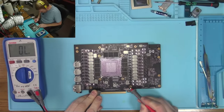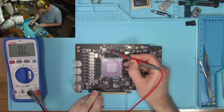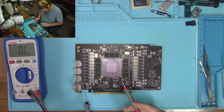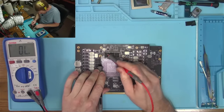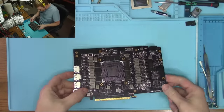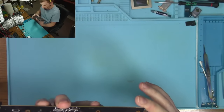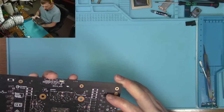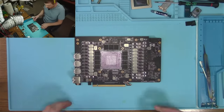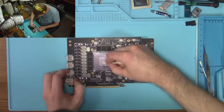Depending on who did, how this board was connected, specifically the controller for the memory phase and the core phase, it will dictate the outcome of whether or not the 4 volts is going to shoot into it without the core. That's the issue. You remove the core on 30 series cards, you run into a risk of shooting 4 volts into the core. I mean, into the circuit.